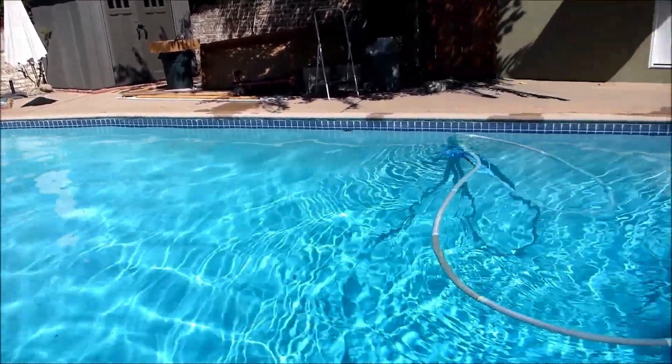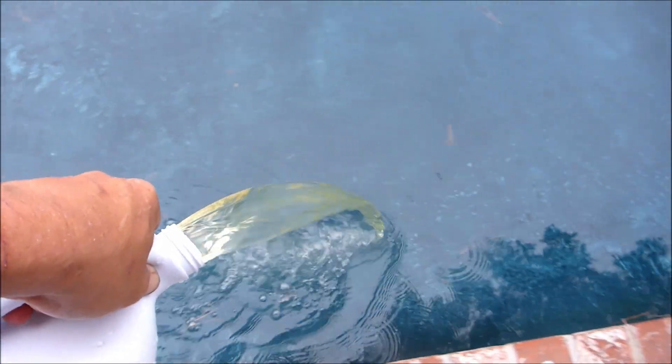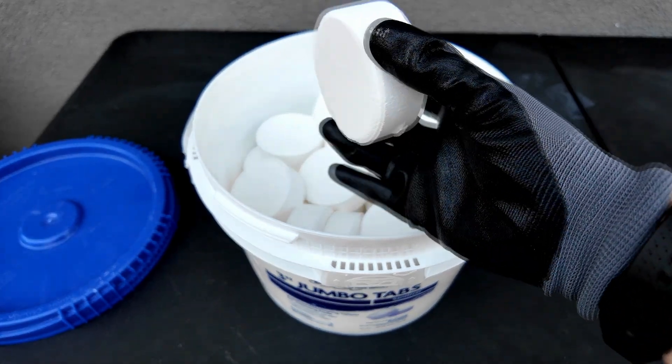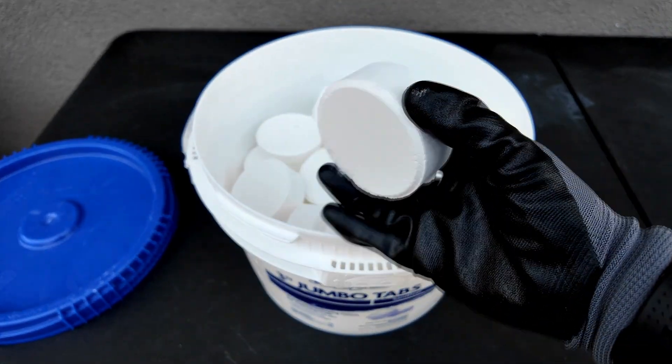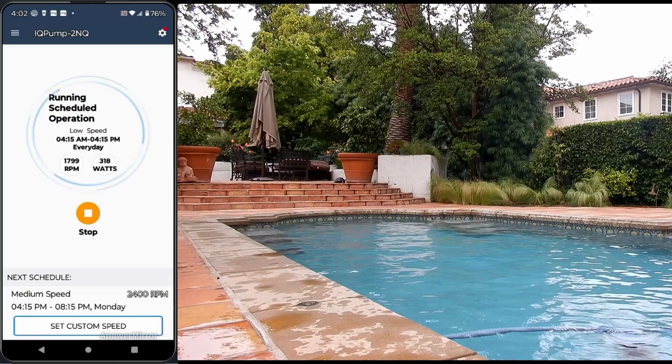The reason why you're circulating the water is to make sure that the chlorine reaches all the areas in the pool and that the pool is sanitized — which means the chlorine has the ability to kill bacteria, viruses, and microorganisms that may be in the water by being circulated thoroughly throughout the pool.